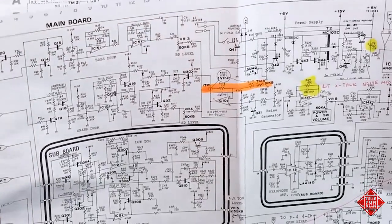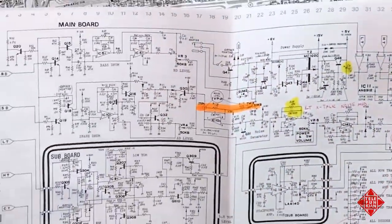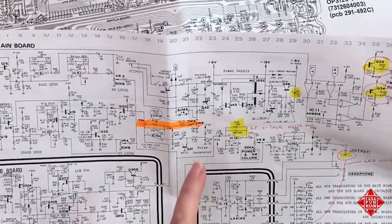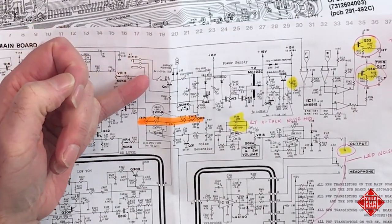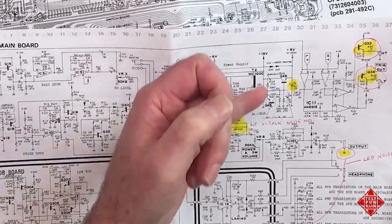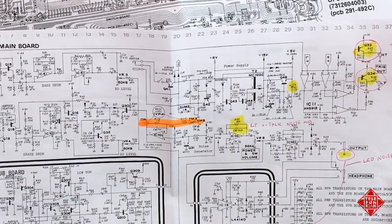And so when it comes to the actual power supply, the main power supply is detailed on this second page of the schematics, and it describes the power that comes into the instrument, which is this DC, more or less nominally 9-volt supply, which is then processed into a positive 6-volt supply, a positive 15-volt supply by virtue of this transformer, and then a positive 5-volt supply.